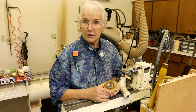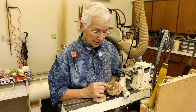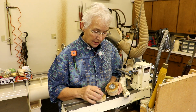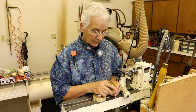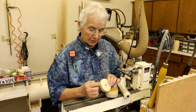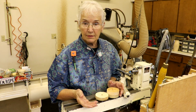Here's the Frugal Woodturner's tip. Since this lathe has a 1 1/8" spindle, you can buy a 1 1/8" lock nut and remove the nylon part of the lock nut and drill a hole in a piece of wood and embed this lock nut and epoxy it in place. And these faceplates can be used over and over again until they get so short that you start running into metal. Then you just glue another layer of wood on top of them. And for classes, typically I would be preparing a couple dozen faceplates at a time.